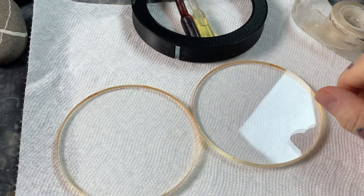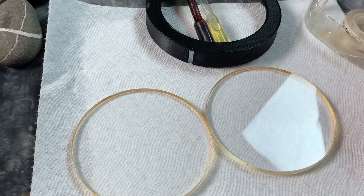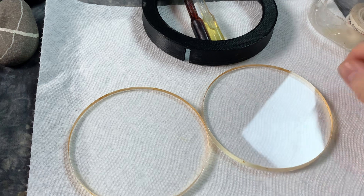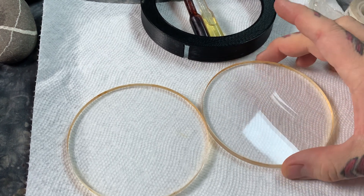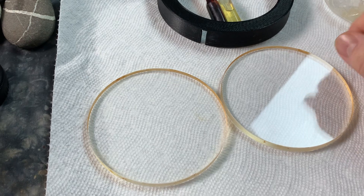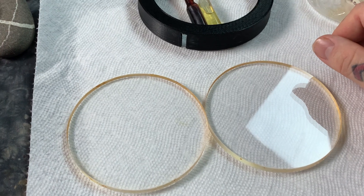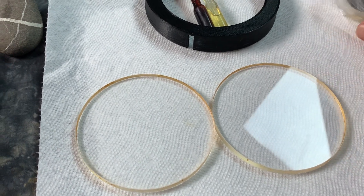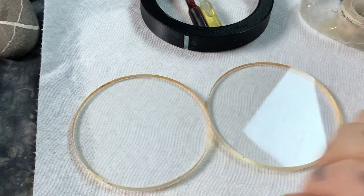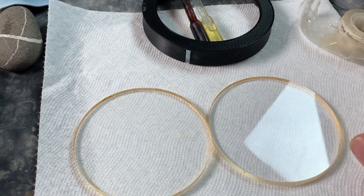I have to tear them apart all the time because the magnetic field image gets burned in — not literally burned in — from the magnetic field. So I'll just tape it at three equidistant corners using some clear tape to hold it in place. The vacuum of the liquid between the glass will actually hold it into place once you wrap the LEDs around it. Since you'll need to rebuild it after using it a lot, make it easy to tear down. I just use three pieces of tape, pop it out, and use regular dish soap to clean the oily residue of the ferrofluid off in the sink, then dry it. It only takes a couple minutes.